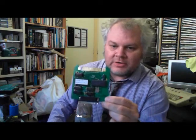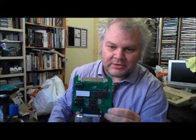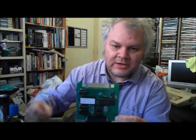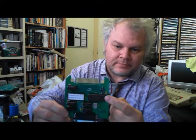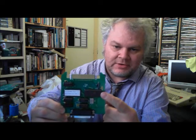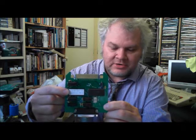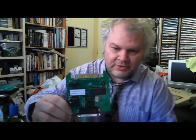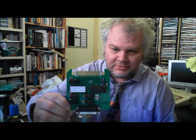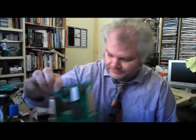For people who don't have an RS-232 serial port, I've started making a modern reproduction. It has several sorely-needed improvements for the Coco world: gold-plated connectors for reliability with no more oxidization, a Rockwell R6551 serial interface adapter, a 2764-compatible EEPROM chip that's socketed so you can load your own program such as DriveWire, and the 1488 and 1489 line drivers are also socketed — so if you blow them, it takes just a couple of minutes to swap them out and get back up and running. If you're after one of these, get in touch with me.